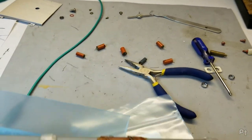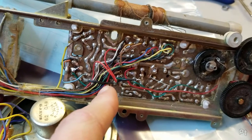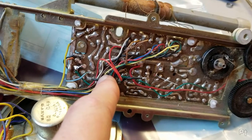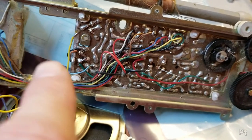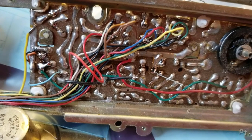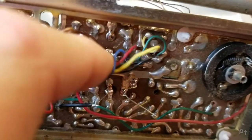That's how many I went into. I started with the amplifier, knowing that it wasn't in the amplifier stage, and I've been working my way to save these horrible ones for last, because I gotta unsolder this little bridge wire here, pull all these up, and then deal with it. So yeah, step by step, step by step. And it's real hard to make this look nice.